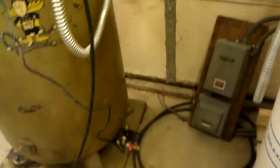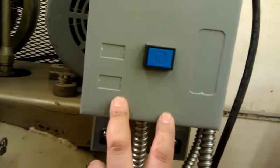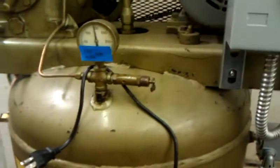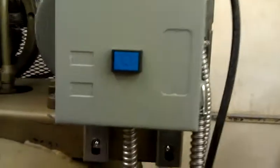The one thing I didn't get quite right on the tank drain is that originally I had mentioned I wanted a 220-volt version so I could tie it into the bottom side of the contactor with both legs. However, this version is only a 110-volt model, so my idea of tying both legs into the bottom side of the contactor is not going to work — I'm only going to be able to tie one.